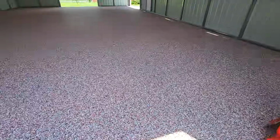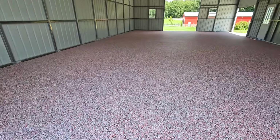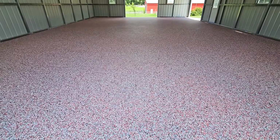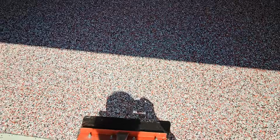So pay attention. I'm only going to explain this once. I'm probably not going to film the scraping part because it's like watching paint dry. So what we're going to do now, in case you missed it yesterday, shame on you, and you're skipping this part. What are you doing? Why are you doing that? But we came through, we ground down the floor, epoxy primer, intermediate coat, and then we flew a custom blend of flake here. So now we have to go through, the name of the game is to scrape up the excess flake. So I'm gonna go with my scraper, handy dandy scraper.